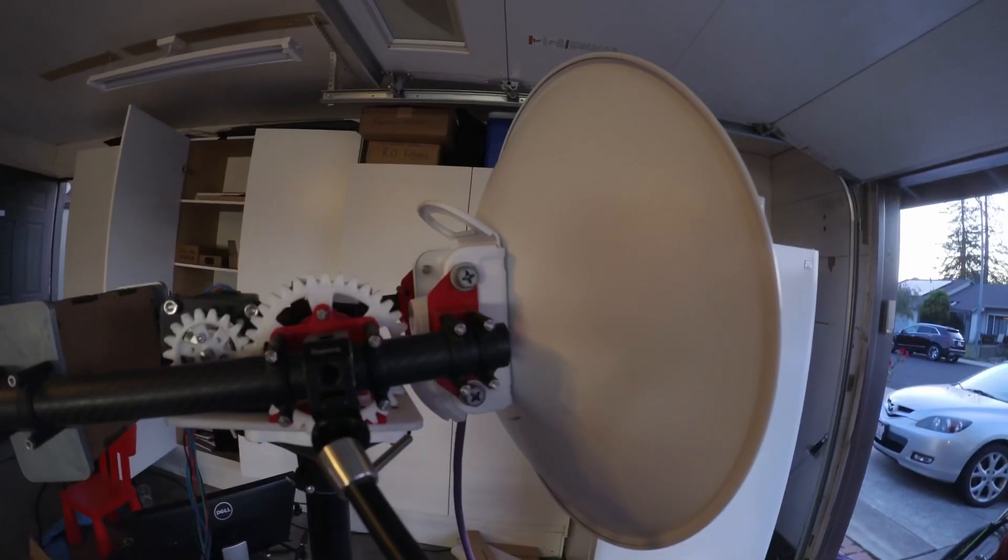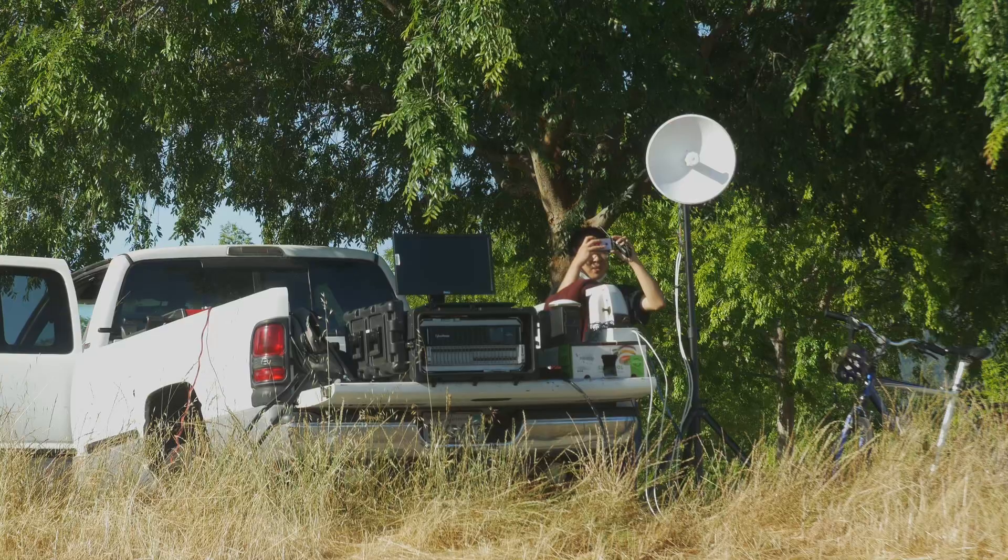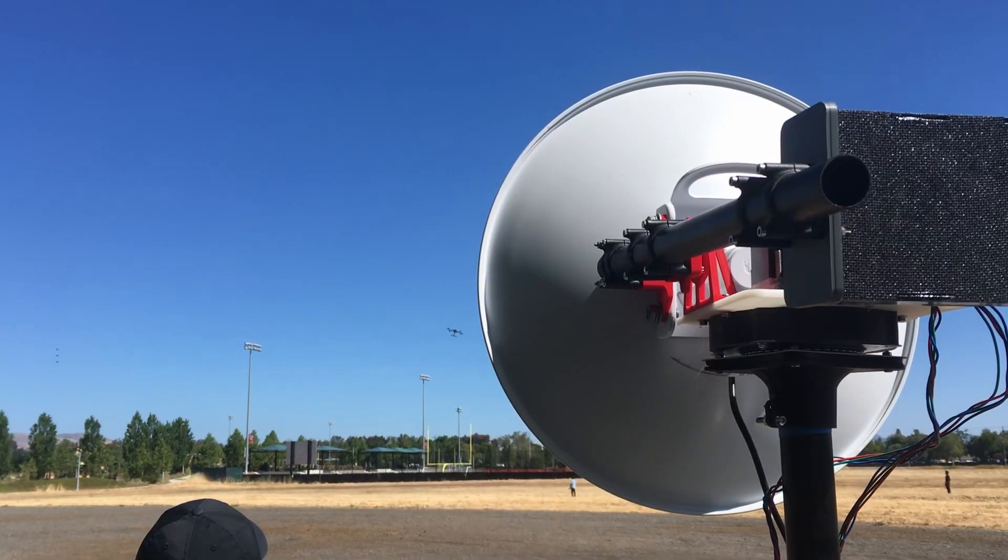To achieve our Wi-Fi link, we use a directional antenna on the ground and an omnidirectional antenna on the drone. We decided to build a two-axis antenna tracker system, which accurately points the antenna at the drone while allowing another flight line member to manually classify images. To guarantee the best chance of success at the imaging task, our Photographer module onboard the drone both logs images to the SD card and transmits them live using our Wi-Fi link. That way, even if the Wi-Fi link goes down or has issues, we can always pull images off of the physical storage from the drone.